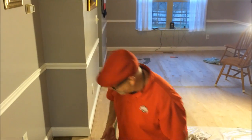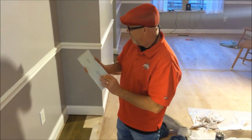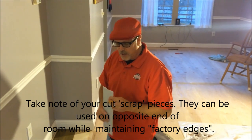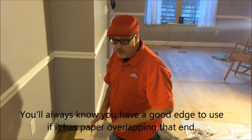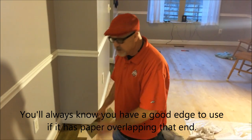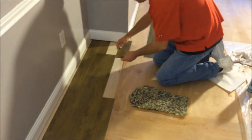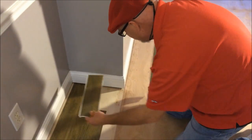When you're not in a speed zone, you've got some cutting to do. I'll show you some easy ways to measure and cut. You can see the arrows pointing that way, so this is going to lay that way. I know because of the paper remaining that this is a factory edge. Just like when laying the underlayment, you want to put factory edges to factory edges as much as possible. Here I didn't compromise — every edge is a factory edge. Watch how easy it is to measure: that's the factory edge, all you have to do is flip it. I'm going to go just under the baseboard, then mark it for my paper cutter. When I cut that, it's going to be the factory edge down here, so the cut edge will be going under the baseboard.